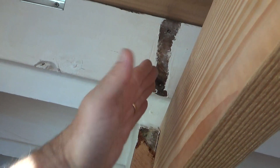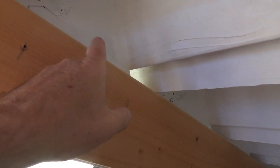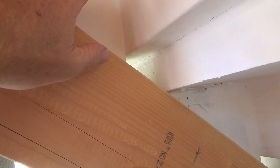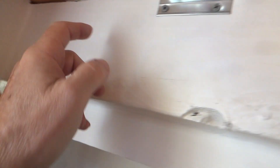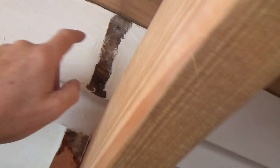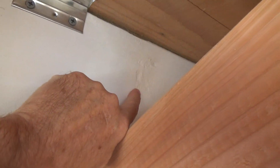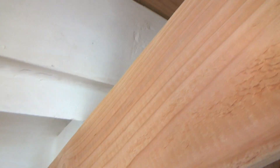And I'm also going to put some pieces up in here for this stair riser. Because where this was, there's nothing holding the stair riser right here. On the original stringers, everywhere where it goes up, this riser's nailed — it was nailed here, it was also nailed where this riser was. You can see where the old location is right there.